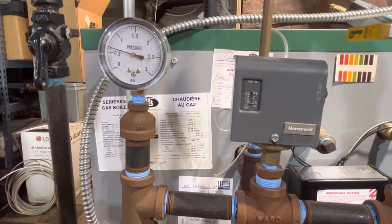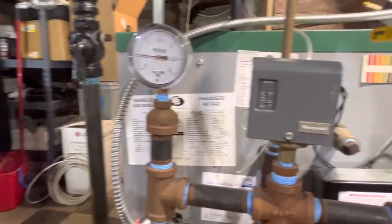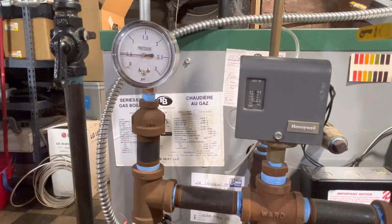My main vent let go over there and just let some air come in. So we're coming into vacuum a little bit. I mean, we're not at vacuum yet, but something over there made a little bit of noise. I think my main vent was breathing a little bit, like it might have gotten cooled off and opened up a little bit. I don't know. Anyway, if you got a vapor stat, set it pretty low too, because there's just no point in building this pressure. That's my opinion.